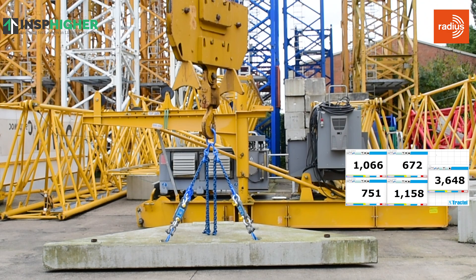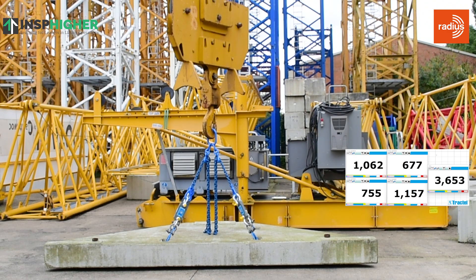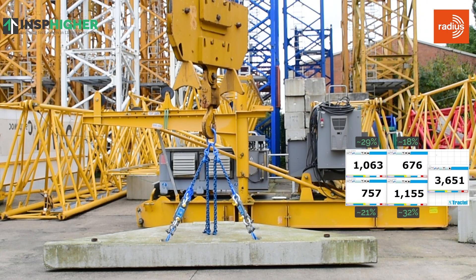In this case we've now got a four-point lift. We have four legs of even length at around about 60 degree included angle, and we're looking to see what the loading is currently on all those legs. Looking at the load on each leg, we can actually see that even though it's an evenly balanced four-point lift, we don't have even loading on each of the four legs. In fact, two of the legs are taking far greater load than the other two. Rather than 25% share of load on each leg, the heaviest leg is taking around about 31 to 32% share of load on that assembly.